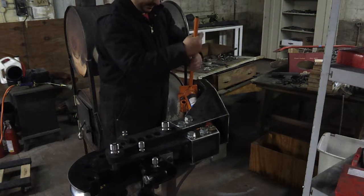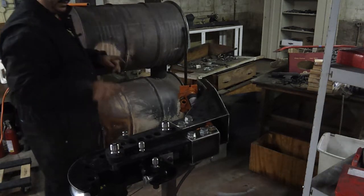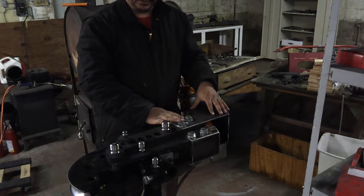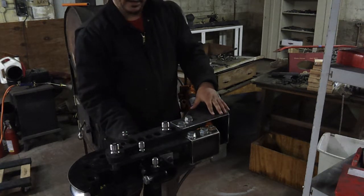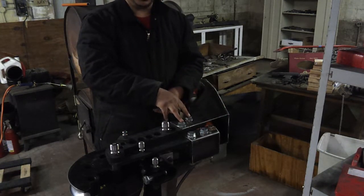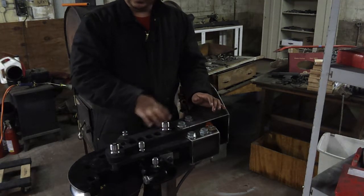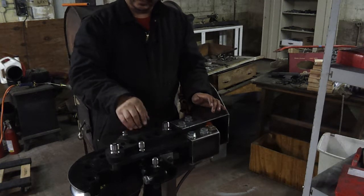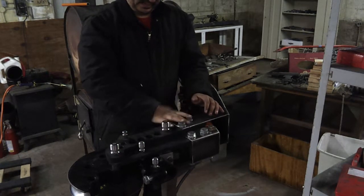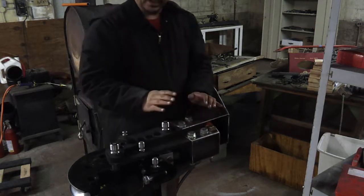You see why I haven't boxed in this area. There's actually one other reason I didn't box this in. If I choose to sell this, one of my concerns is that this top bar and the bottom bar are smashed tight with these two bolts — these bolts are very much a structural deal for this. If these are not as tight as they're supposed to be, this whole thing is going to have slack and play in it. These pins are going to be hard to pull out of here — it's just not going to work right. These bolts have to be tight.